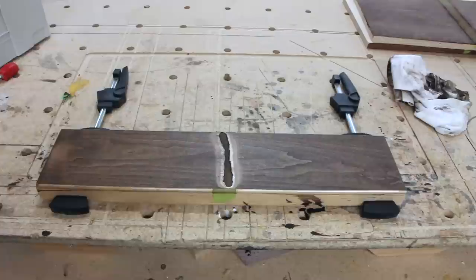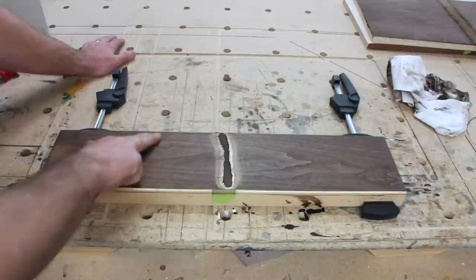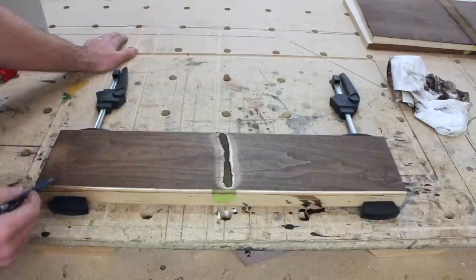On the solid wood test, there's a light spot here where the Festool didn't quite sand very evenly. The Mirka side is quite even in the penetration of the stain, whereas the Festool side is a little bit off — this could be a shallow spot in the wood, but it doesn't seem to be. The Mirka gave us a more consistent sand pattern which helped us get more even stain penetration. You always have to be careful with sanding marks in the corners, but the Mirka won on this one again, and it also took the finish off faster.